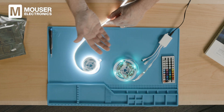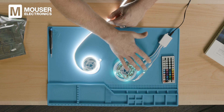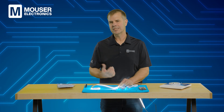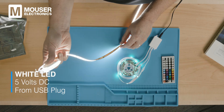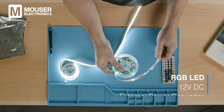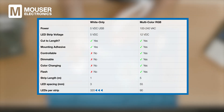Clearly the biggest difference between these two LED light strip systems is that one provides only the single color white, while the other provides control of the color, the light intensity, and blinking through an external remote control. The power supplies are also pretty significantly different — this one uses 5 volts DC from a USB plug, while the other uses 12 volts with an external power converter. The white strips are only one meter in length but have 320 LEDs per strip, very tightly spaced at about 3 millimeters apart. The RGB strip is five meters in length with 55 millimeter LED spacing, giving you only 90 LEDs on each strip.